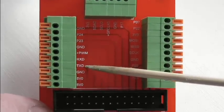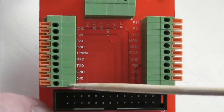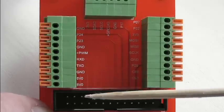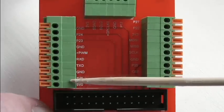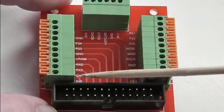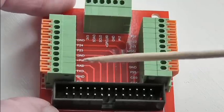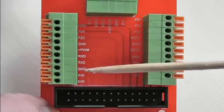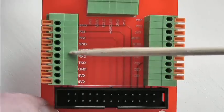What I would like to see is perhaps a sticker — maybe sold as an optional extra — that you can put on here right next to the holes where you stick the wires, so there would be no possibility of confusion. For example, that's a 5-volt connector there, that's another 5-volt, that's ground. From certain angles with parallax error, one connector looks like ground but actually it's the other one that's ground. So unless you're right on top of it you have to be very careful — I think you could make it even more foolproof with labels there as well.